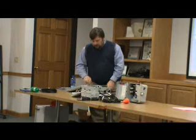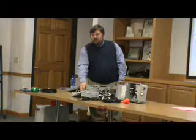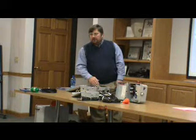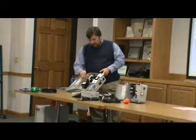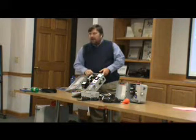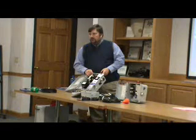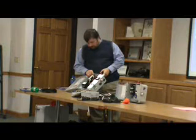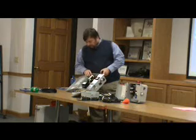In the bottom of this one, you'll see that we have installed cable grips. What this is basically built for is to keep the sewer gases and stuff out of the inside of the panel. If you get sewer gases up inside the panel, it'll start to turn a lot of the copper stuff in here black, and you get some corrosion. You don't have very good working capabilities for the panel. I think that pretty much covers all the stuff that's in this panel.